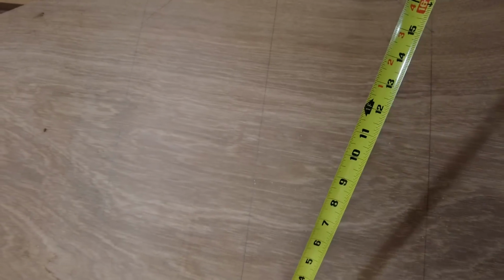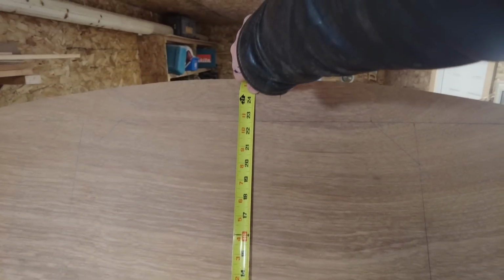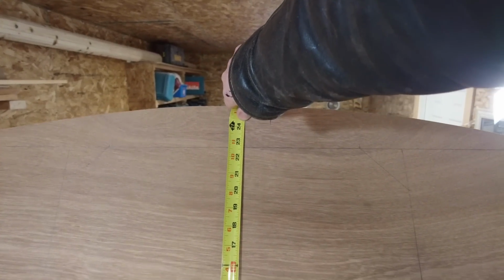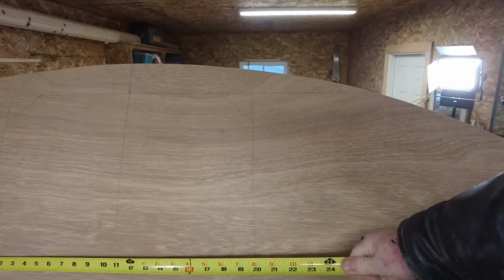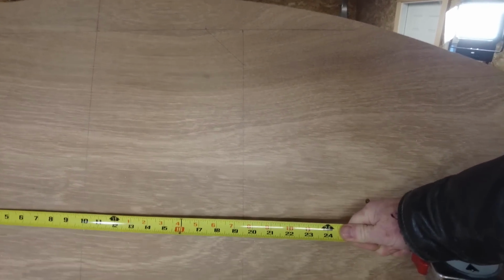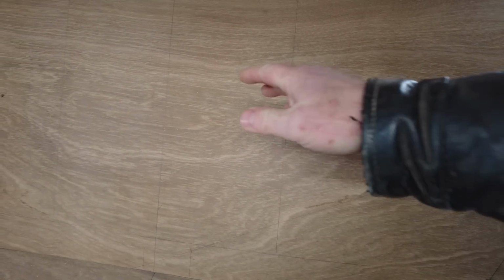So on the hatch here, I have, starting down there, that's a good 3 inches off the deck, and up to a point that I've determined at 22.5 inches, I can build a hatch that's 22.5 inches tall and as wide as I want. Here I have it at 20 inches wide, but I could make that wider. And what I'm thinking is more a door style hatch that would be hinged and then would open horizontally, and I'd be able to get in and out.